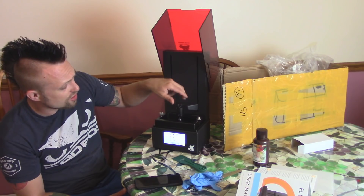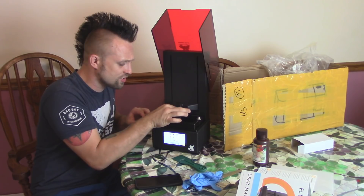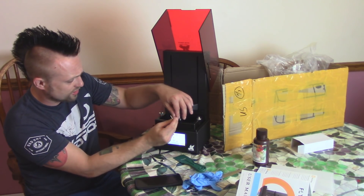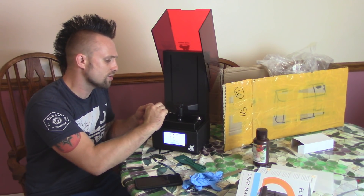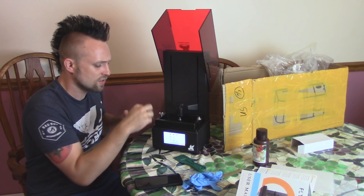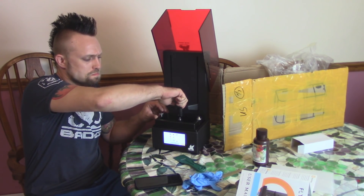This is really easy to level the bed. All I had to do was loosen this all the way up and drop it all the way. I had these two screws loose just to make sure it's lined up good, so I'm going to tighten those down — just these two Allen heads here. You want to get it snug but don't strip it or anything. Don't go crazy.